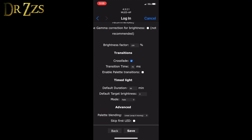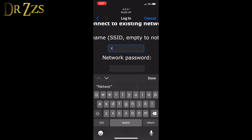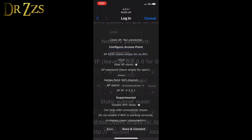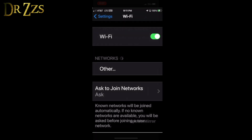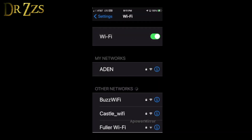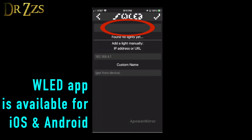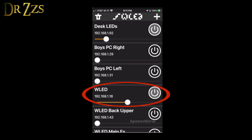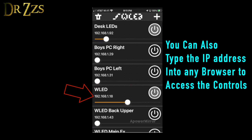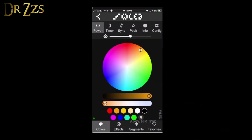The last thing to do is connect it to our WiFi network. Go to WiFi Setup, put in the name and password for your WiFi network, then click Save and Connect. Assuming you've got the name and password right, it will connect to your home network and the WLED access point will disappear. To find your new device, go to the WLED app, hit the plus, and then Discover Lights. Hit the check mark, and when you go back you should have a new WLED device. You can click on the device to access the controls, or take the IP address and put it into any browser on any machine connected to your network to access the controls for this LED controller.